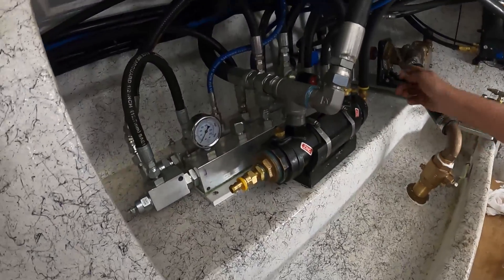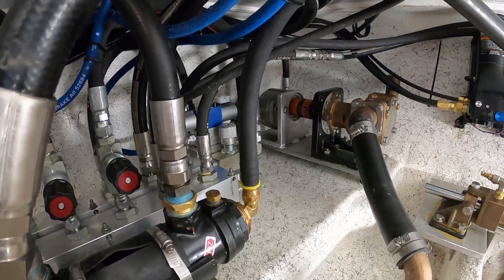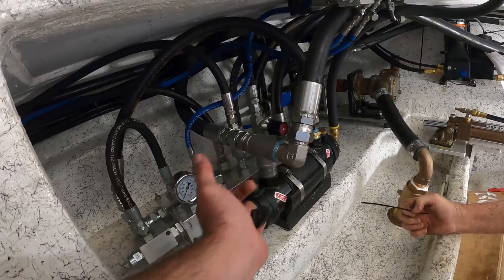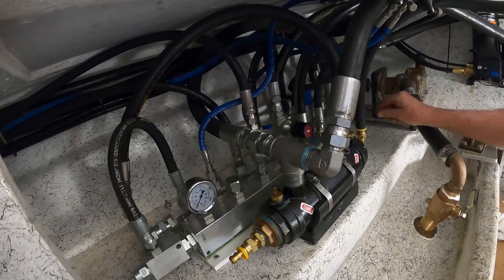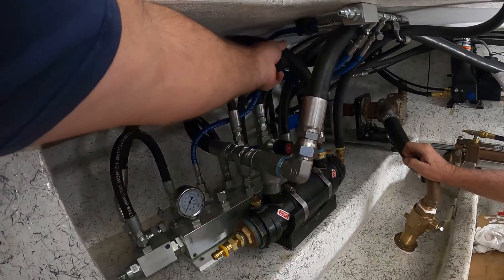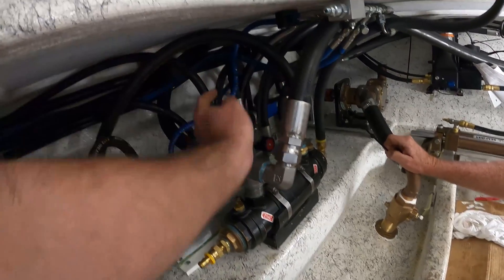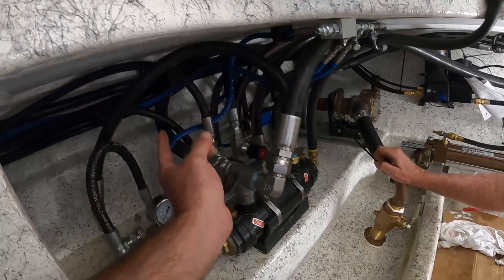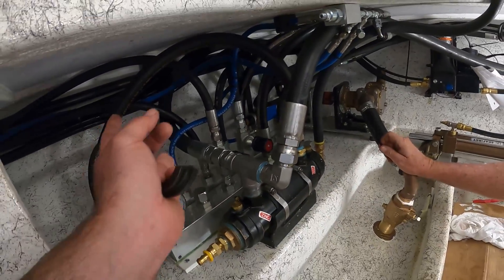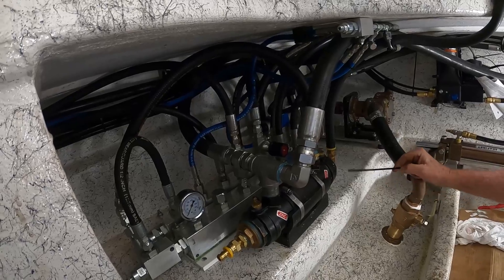If this system is running too cold, we open this valve up, which allows more flow through this hose and back to tank and less oil through the heat exchanger hose. So this is just a pass-through — those are kind of equalized in a way. But we can put resistance on this one to increase flow through the other one. You can't necessarily stop flow through this completely — the resistance just slows it down somewhat. If that's fully open, this hose is larger and this will have some resistance, so a little more fluid would flow through the T and straight out. But then you choke that off and it forces more through the cooler and back out to the tank. So the path of least resistance is through the larger hose, and that's by design.